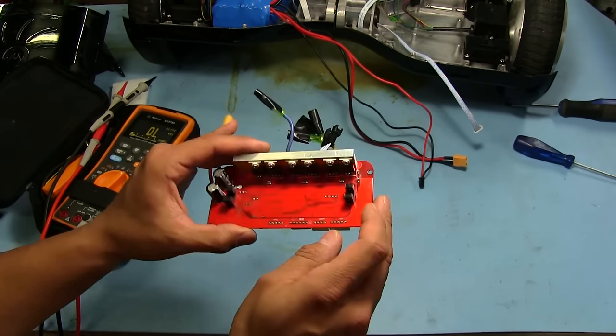And we're just going to do a diode check on these and make sure that none of them are reading shorted or anything. I'm assuming one of these is going to be PNP and one of these is going to be NPN. I'm making assumptions here, but usually this is the way it goes, that this would be the base. And showing almost a 0.7 volt drop there. This one here would probably be the collector, and that's showing about the same, so that looks pretty good. Let's check this one here. I don't know if this is going to be the same or not.